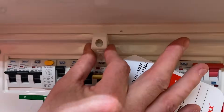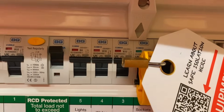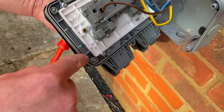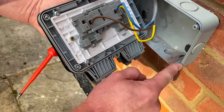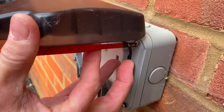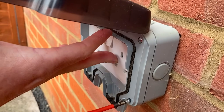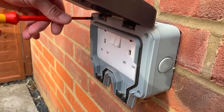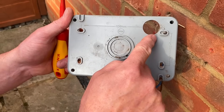Before working on any electrical system you must carry out the safe isolation procedure — I've done this off camera, and I'll leave a link to a CPD in the description below. Let's take a look at the original socket outlet on the wall and how it maintained its IP rating. This seal against the back box was relying on the screws in the front of the socket all being done up to the correct tightness — if one was under-tight or over-tight, you could actually affect the IP rating of the enclosure.